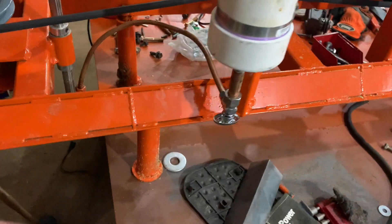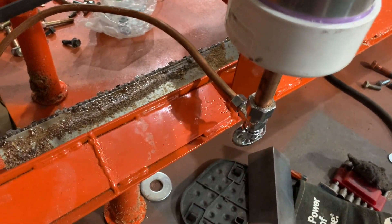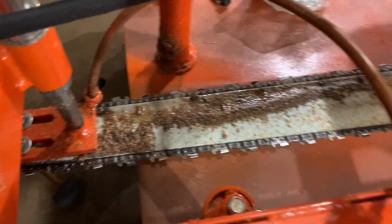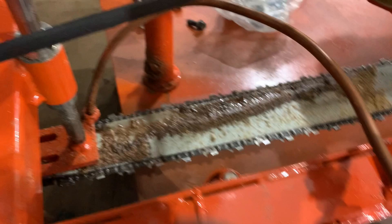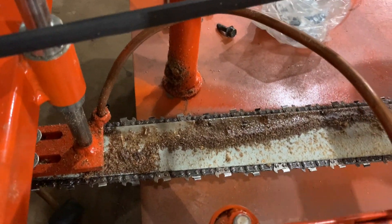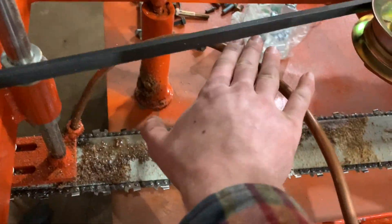The oiler — I'm going to change out this toilet valve. Too much flow, too hard to control. As you can see it was just barfing oil out even when I tried to crack it. So I'm going to change this to a needle valve or something smaller so I have finer control over what's coming out, and I'm going to change this to a flexible hose so you don't have to mess around with it.